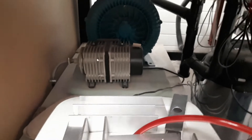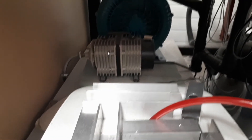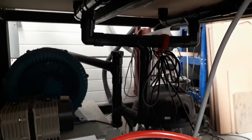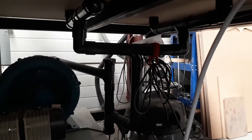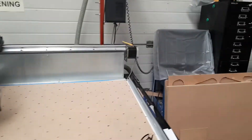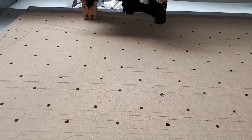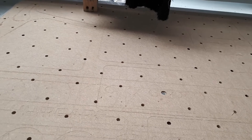There's the blower at the front for the air supply to the spindle, and the bigger one behind is the 1.5 kilowatt fan for the vacuum bed, installed with a very basic plumbing system. It works extremely well for holding down thin sheet material — whether cutting acrylic or aluminium, it holds it immensely flat. Whereas if you try to screw it down at the corners it can bow in the middle and never cuts properly. This was a worthwhile investment.